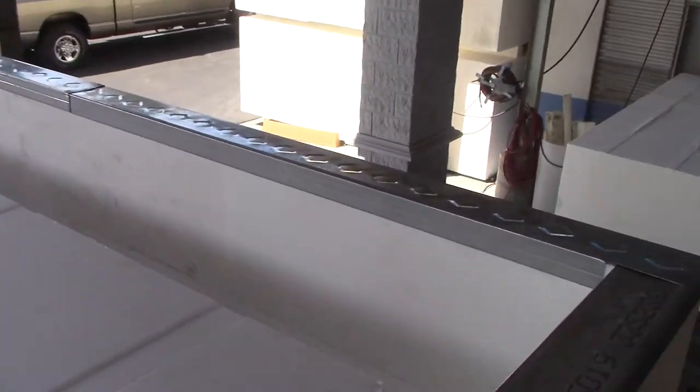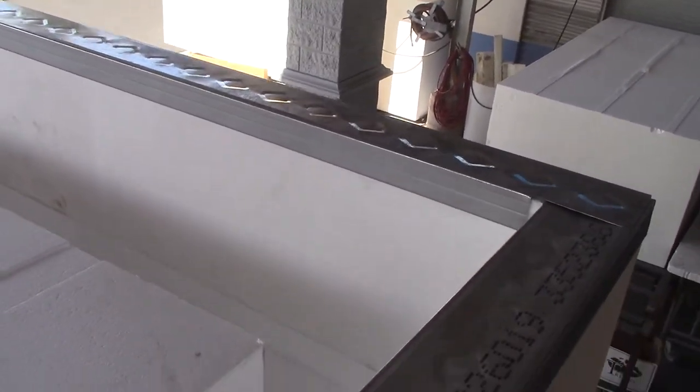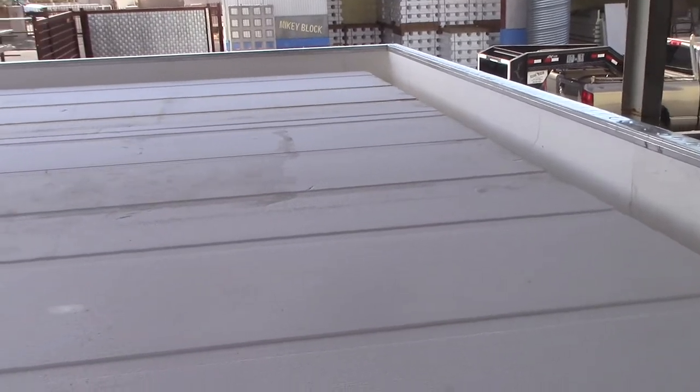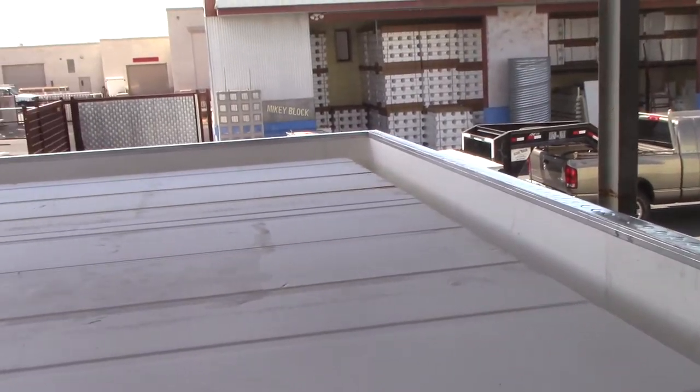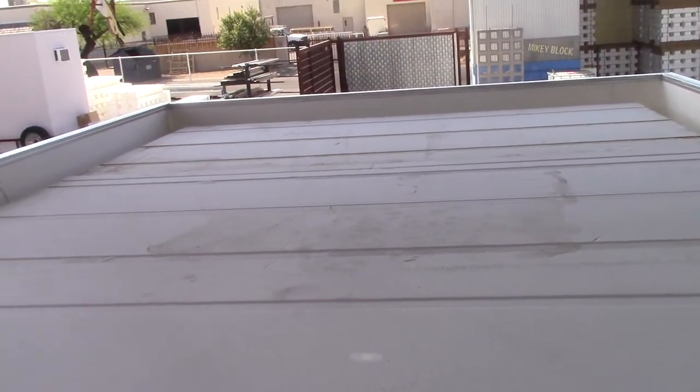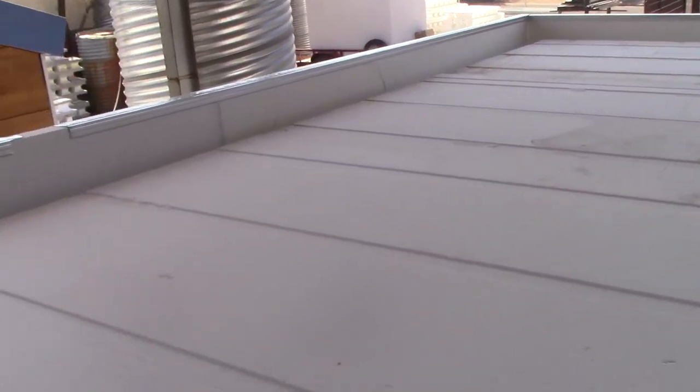And then here's the upper deck. These things over here will provide a 4-inch thick concrete deck on top. Obviously you want to put at least 4-gauge welded wire fabric in it, or you could do a grid of number 4 bar, and you can grout this whole shebang all at once. Takes about 5 1/3 yards, probably order 5.5. Anyway, that pretty well shows it all.